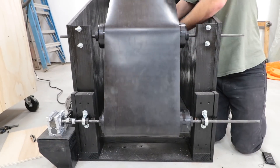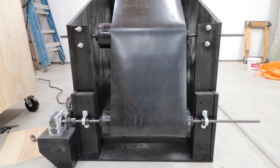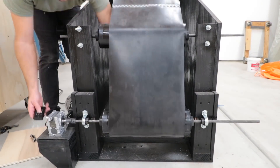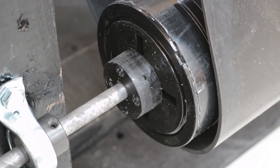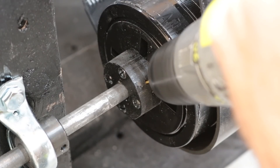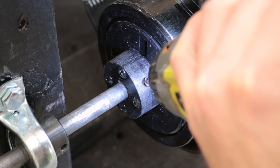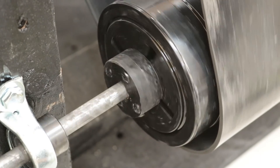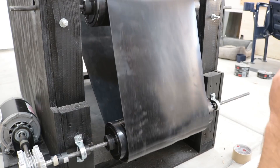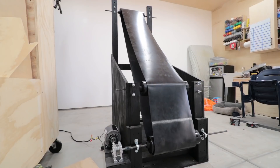I added a few strips of tape as it was rolling, making micro adjustments to work the conveyor towards the center — just trying to find that sweet spot. The potential point of failure at the moment is the connection from the metal rod to the wood of the roller. In the future I'll probably add a pin that goes all the way through, but for now I added a jerry-rigged version of a set screw that prevents slipping. Just seeing this thing run is super exciting — it's one step closer to having a reliable, quiet, high-capacity marble lift for all of my future marble machines.